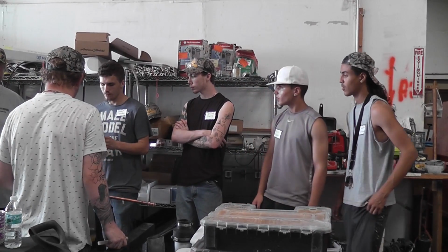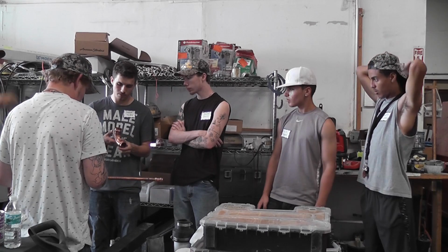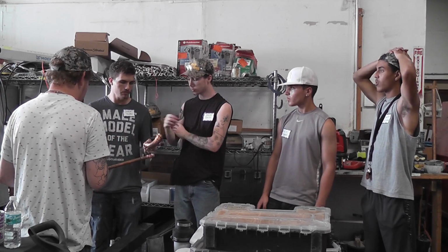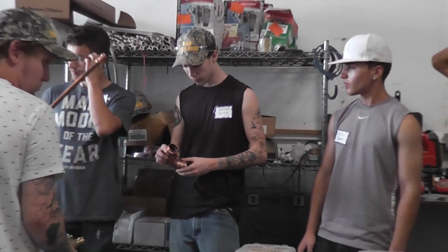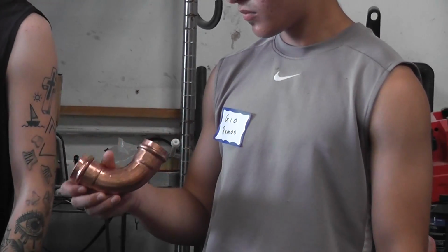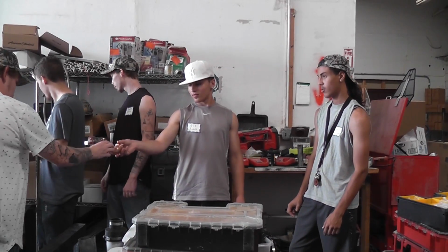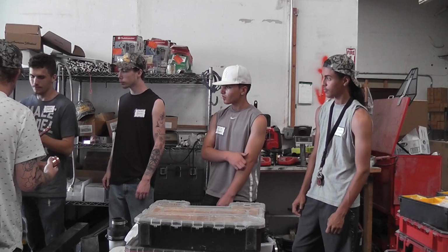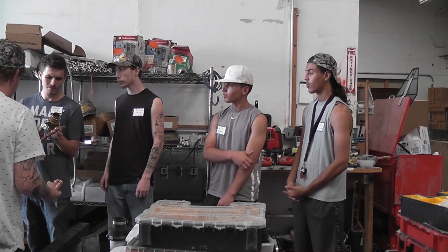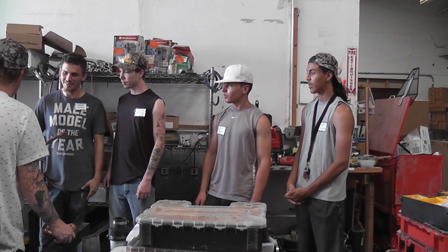The fitting you put right there is about $40. But if you can't shut water off, man, it's a lifesaver. We do a lot of nursing homes and retirement homes, and the valves are old, you can't shut them off. So I can literally take that machine under pressure, cut a line with water running wide open, pop that on there, press it, shut it off.